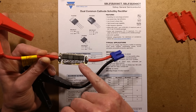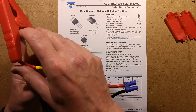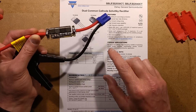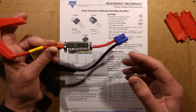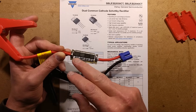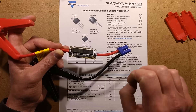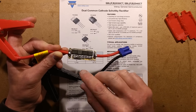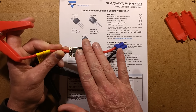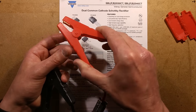Getting back to these chunky little diodes: there are four packages, two diodes in each, so eight diodes total. Each one is rated 10 amps continuous, presumably with heat sinking. In this case they're probably seeing closer to five times that - maybe about 400 amps peak. That's okay because diodes have a peak rating: the 1N4001 is rated 1 amp continuous but handles peak surges of about 30 amps, designed for things like the initial surge into a capacitor through a rectifier. They've basically jammed as many diodes as they could into this small area.